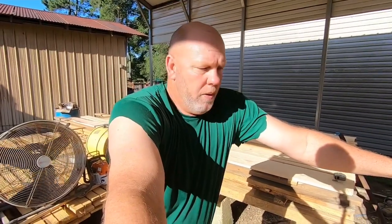There's several different people that cut different ways on these sawmills. I cut my stuff down to scale. So my 2x4s are the same size as what you buy in the lumber yard. Once they dry, they're pretty close. That's without planing them or nothing. If you need to plane them and cut them down some more, you need to oversize them.